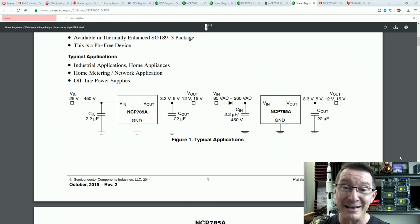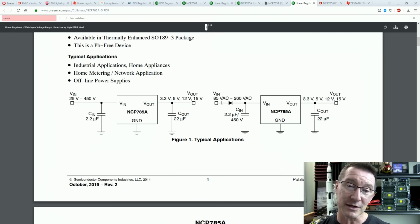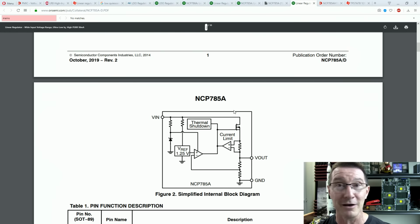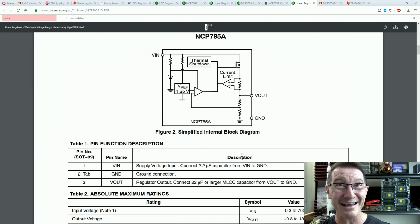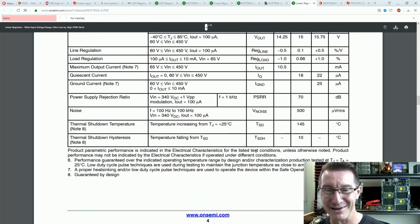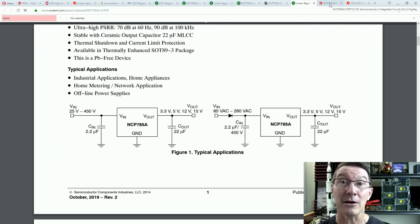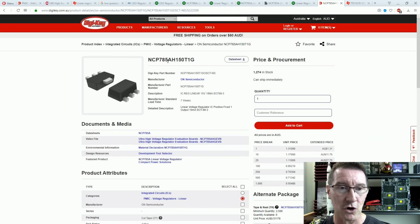Right, the whole thing, even probably the worst smoke sensor circuit on the market, is going to be like sub 100 microamps with this thing. So yeah, you're still going to get poor power factor, but it's going to be like an order of magnitude better than the Zener solution that they're actually using here. No doubt about it. So it literally is as simple as that. And tell us the price, son. How much does it cost?